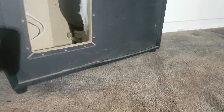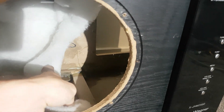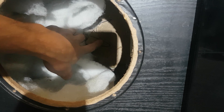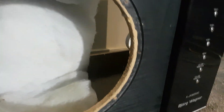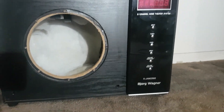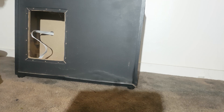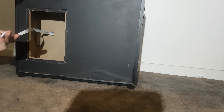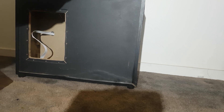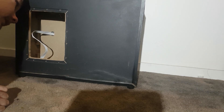So it's not overly badly built. Getting a closer look at this box — your eyes are not deceiving you, there's a brace in there. There's a lot of glue — they went all out with glue. It's all poly-filled. The port's over here, glued in — I actually re-glued the port because it was coming loose. Overall it's not too badly built. It's about 15mm MDF wood all around. At least the enclosure is sealed. I haven't got too many complaints about this — it doesn't look too bad. Not bad for a white van speaker.